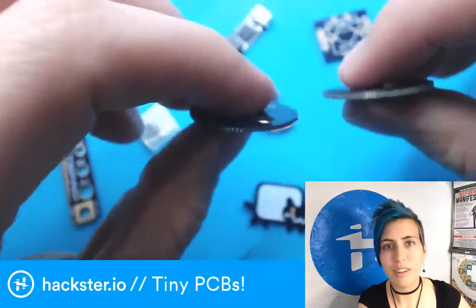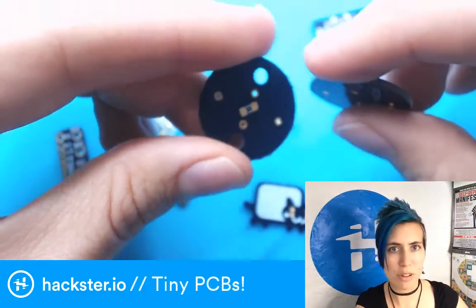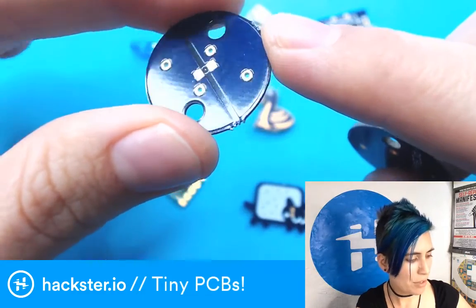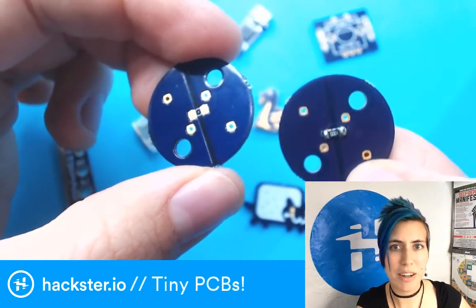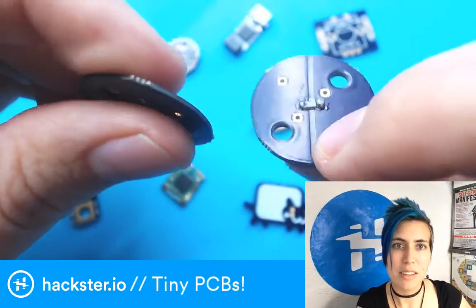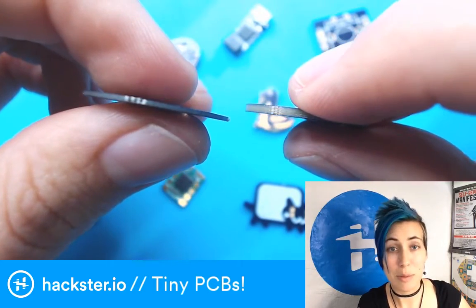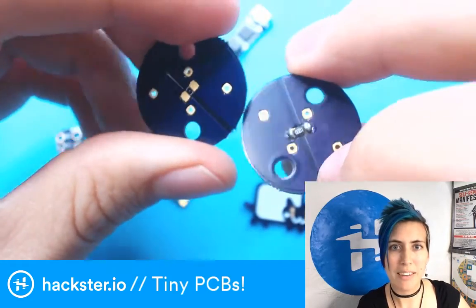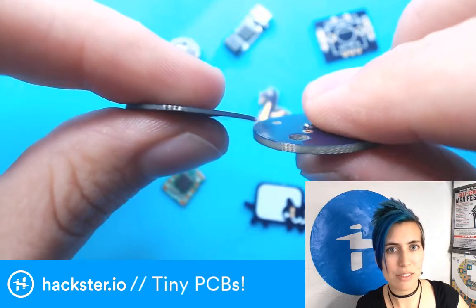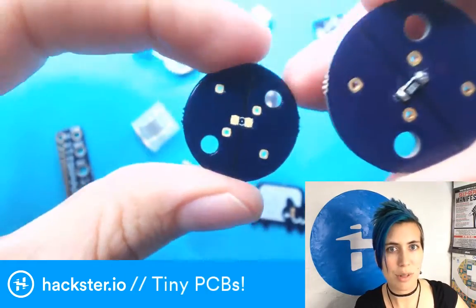I wanted to show you the difference between a half-height and regular-height PCB. On the left I have the new half-height version of my Charmware PCBs — there's still a lot to do before I'm ready to push them, a few more iterations necessary, but you can see how they compare. The other thing about Oshpark is that if you order the half-height ones, they also come with double the amount of copper — double the thickness — which could be interesting in your design. Half-height PCBs are a great way to get less weight, less thickness, less bulk overall. And if you order in large quantity, you can get the edges rounded nice and smooth.